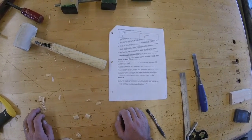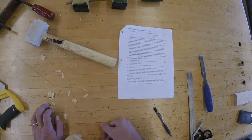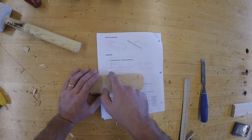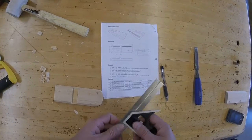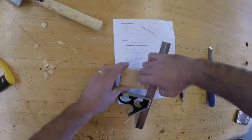Alright, we are on step 20 now. Refer to the drawing to mark the last groove using any method you have learned so far. For this cut you are going to go with the grain, so you do not need to pre-cut the edges of the notch. Use the chisel to remove the material from the groove until it is exactly three-sixteenths of an inch deep. There is not as much direction here — we need to return to the drawing. When I look at the drawing and get my board oriented, I can see that I need to measure one-quarter plus eleven-sixteenths from this edge. I hate math, I hate fractions, so I'm just going to do it the hard way — or maybe it's the easy way. Setting my combination square so it's on an edge, making sure I get this right, my board is oriented the same as my picture. There are my measurements: one-quarter and eleven-sixteenths. I need to measure up this way — I'll do it right here with the drawing.